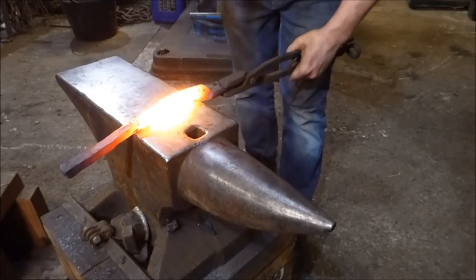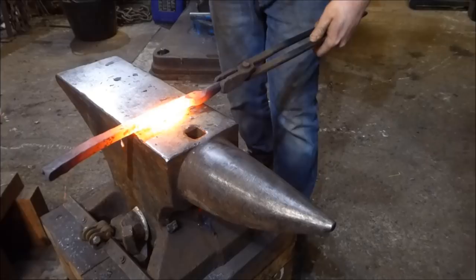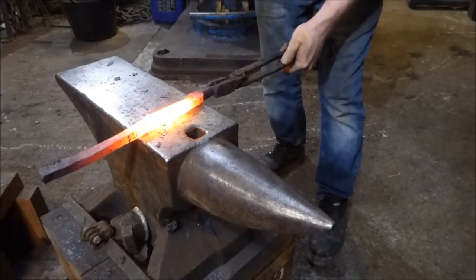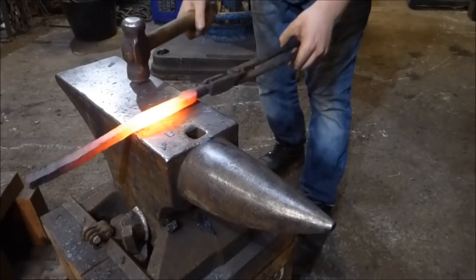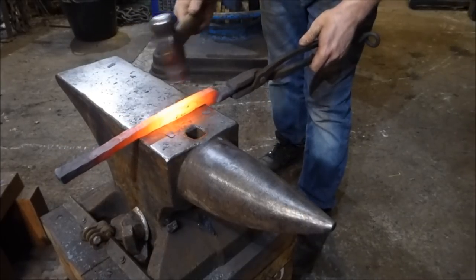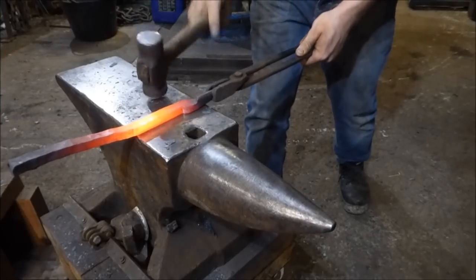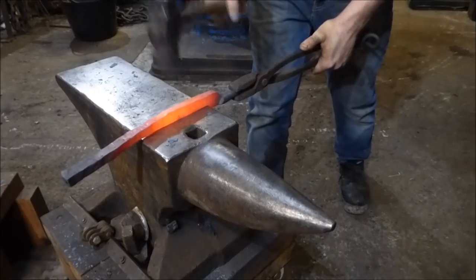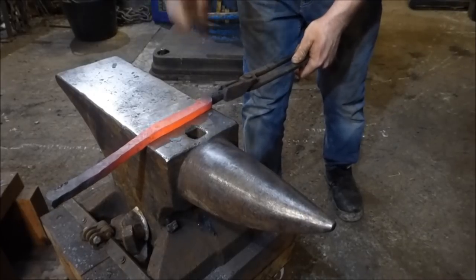Back in the fire. All I've done on this heat is concentrated the heat down the far end to the hinge plate or boss. I just want to take this round side and bring it down a little bit, and now I'm on the flat side of the hammer. All I want to do is bring this to the same thickness as the hinge plate. This is slightly thick here — round side of my hammer — a series of overlapping blows. I've made it quite fat and I'm just going to now bring down on this side.